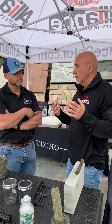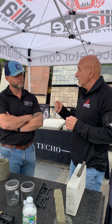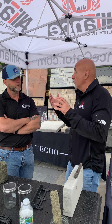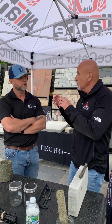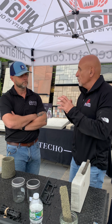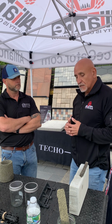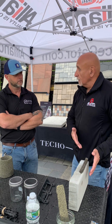So what you want to do is fill that joint, and use a compactor or a vibrator to take all that void space out. Now you've increased the density, you've reduced the void space, and you've got all those polymers a lot closer together. And the polymer is the glue. So the more polymer you get into a certain space, and the closer the glue is together, the stronger it's going to be. It's going to be less prone to water intrusion. It's going to be denser.